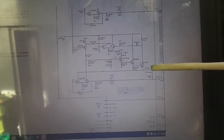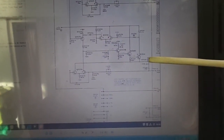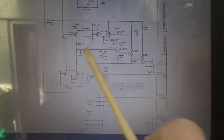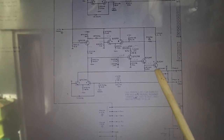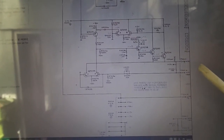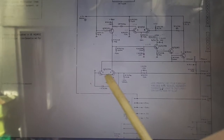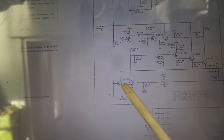I've just checked this diode here that is showing short on the diode test, both ways, but it's reading 40 ohms. So now I'm thinking — what if all this circuit here is OK and we've got a short somewhere else or a partial short to ground? As far as I can see, this is how it works: you've got 15 volts at this end, and then there's a signal coming back — some sort of filter — and then this goes to a long-tailed pair.